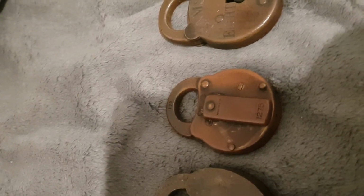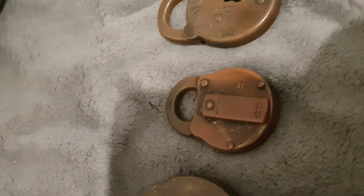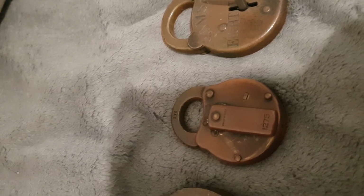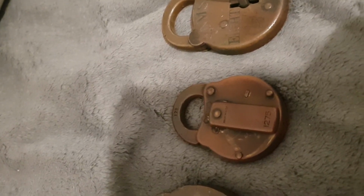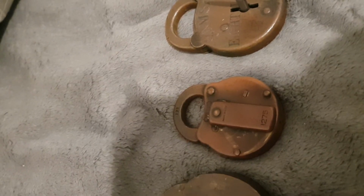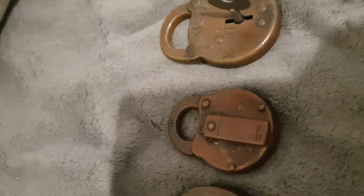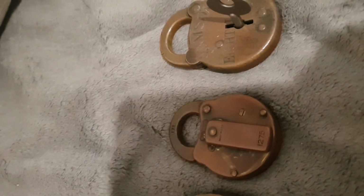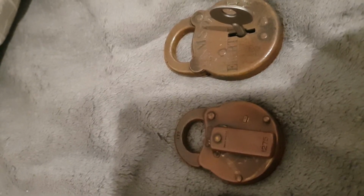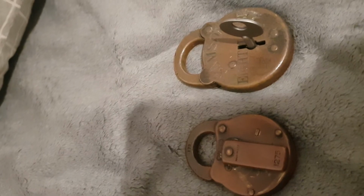And why is that bad? Because when the tumblers' surfaces do not line up properly with the key bitting and there's overlap, you're going to get some friction, and that's going to cause improper wear on the lever tumblers. So for someone to sell a lock with a working key that's not the right key, that's a hack for me. That's a hack. And I just don't like locks that have keys that work like that. A lot of times that can damage the lock.